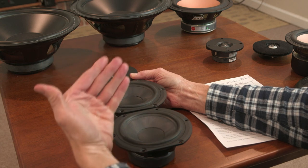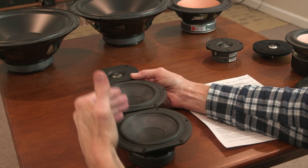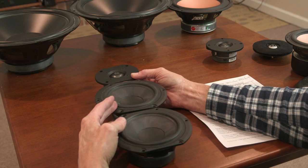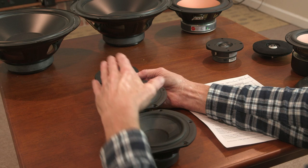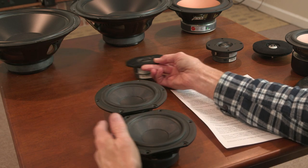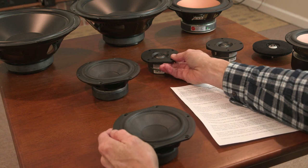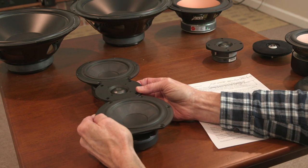Unless it's what's called a 2.5-way design, where the lower mid driver is filtered down at a lower frequency, so it never gets above, say, 500 Hz or something, and the other one is the only driver above that. The two of them share their low frequencies, and then as the frequency rises, one is filtered out and the other carries the frequencies up to the crossover region. But that's not a two-way design, it's a two-and-a-half-way design. I'm talking about shared drivers in a two- or three-way design. You've got some comb filtering issues you want to think about and concern yourself with.